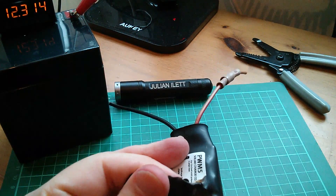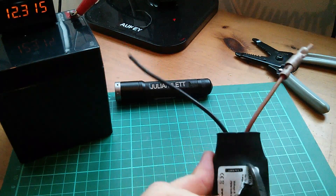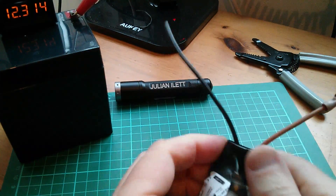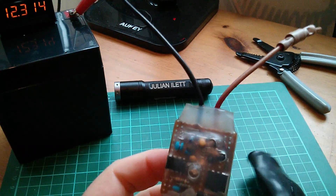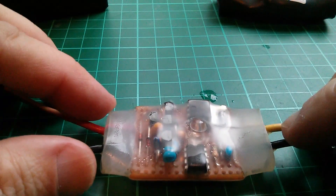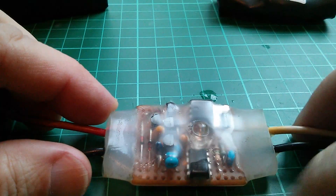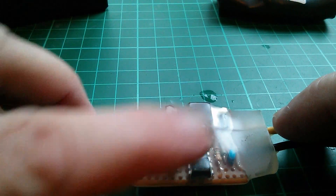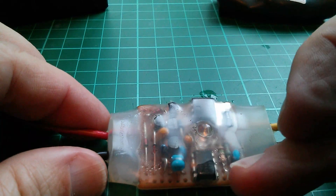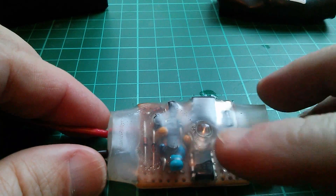I'll be very interested to see if moisture has got through the hot-glue-sealed ends. There we are — and yeah, you can see that moisture has got in. There's water there; if I sweep it, it doesn't go away, so that's on the inside. There's moisture all around the LED and moisture on this side near the voltage measurement potential divider.